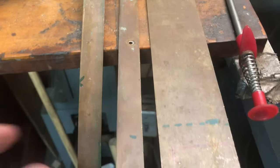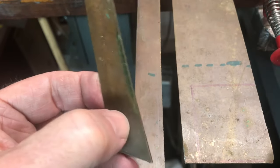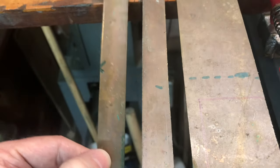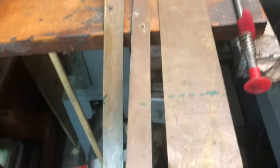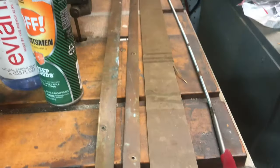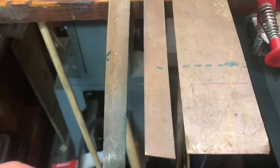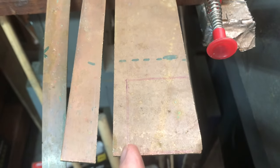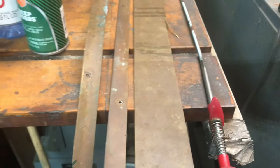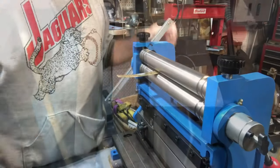You can see some of the original pieces with the screw holes in them. I cut them into three-quarter-inch-wide strips — 44 thou thick — and they shine up really nice. The parts with holes can't be used for the decorative function, but I'm thinking I'll cut these little strips in half to about three eighths inch, then into the proper length, and use them as the underneath part for the boiler. Pretty creative use of old brass — never want to let anything like that go to waste.